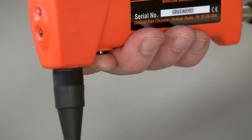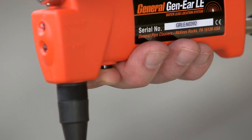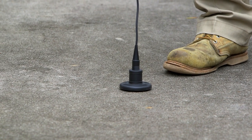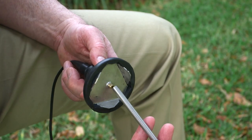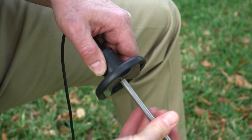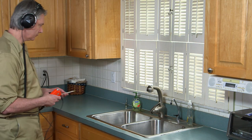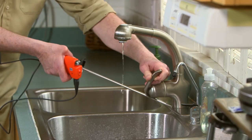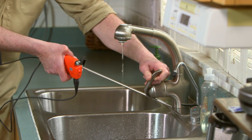Squeeze and hold the mute button to listen to the sound from the sensor. This button protects your ears from sudden loud noises by muting the sound when the button is released. Do not press the mute button while the sound sensor is in motion. But before you can locate a water leak, you've got to know what you're listening for. Here's a tip: set up the Gen-Ear with the probe rod or magnet base, touch the tip of the probe rod to the faucet, then barely turn on the valve so that the water is dribbling out. This simulates the sound of a leak. Turn the faucet on and off until you hear the difference.